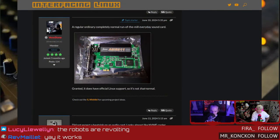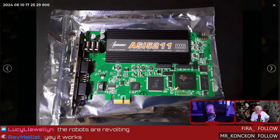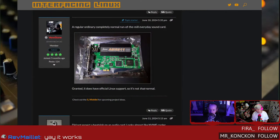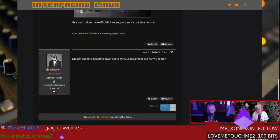I also picked up a completely normal, run-of-the-mill sound card — the ASI 5211, Audio Science. It looks just like a Sound Blaster, but that's not a headphone jack — that is a balanced mic input because it has a preamp built in, along with digital in and out, analog out, and a DSP with a Texas Instruments chip. It's got equalizer, companders, all this stuff built in.